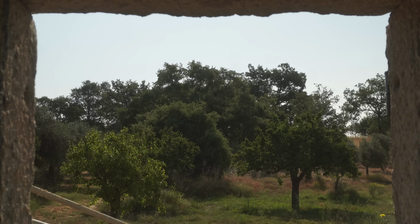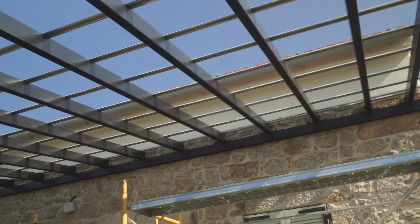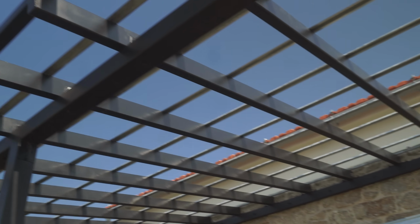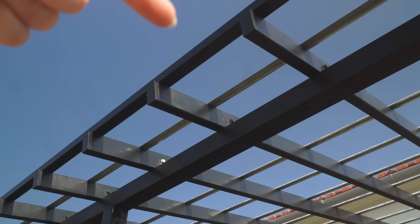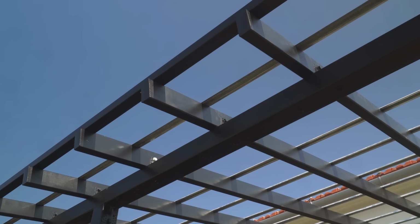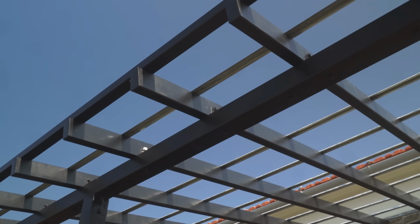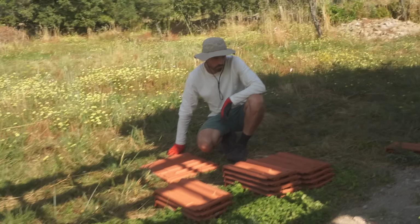So we wrapped up fairly early yesterday. We were both feeling pretty crummy, Ricky with his wisdom tooth, and me, I just really didn't feel like I got enough juice in the tank to do the tiles. But today is a different matter. Before we wrapped up though, we did get all of the tile battens on and secure, plus this extra slightly taller beam at the front, which is going to stop that row of tiles from drooping down and just looking a bit sad.